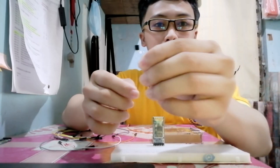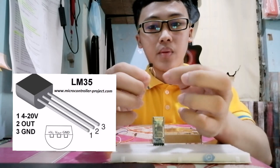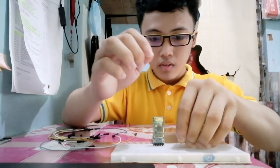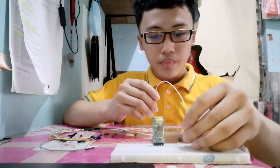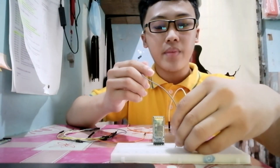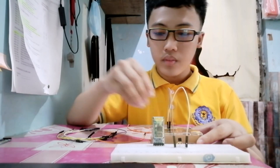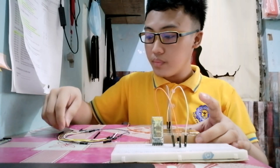This pin here is our VCC and this is our ground. Our first step is to connect the ground pin of the LM35 sensor to the Arduino Uno. Next, the VCC of our LM35 sensor is connected to the 5V of the Arduino Uno. The middle pin of the LM35 sensor goes to the A0 analog input.